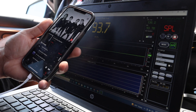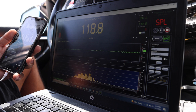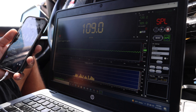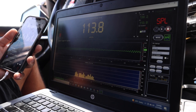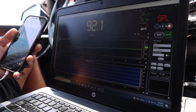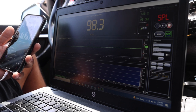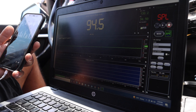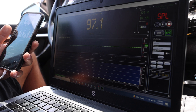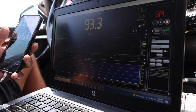Now let's do a little Metallica — Enter Sandman, a classic metal song. This song is a little tricky. You do have some deep bass in it, but there's also some snappy bass as well. That snappy bass is there, but these woofers aren't picking up on it too much — you can hear the really deep bass that's more predominant. That's going to be typical for a box tuned this low, around 35 hertz or so.